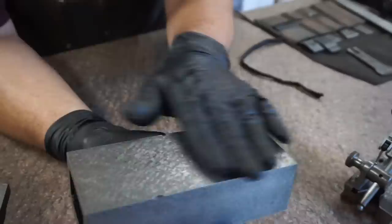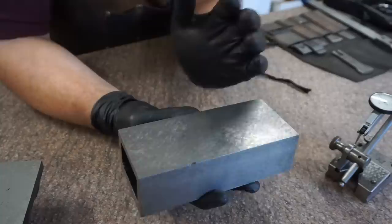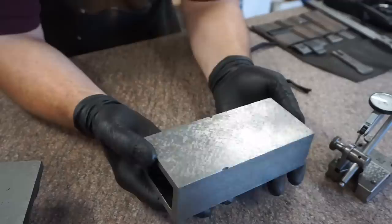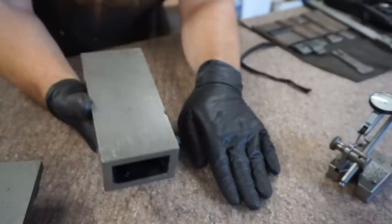And yes, you do need a master plate of some sort, whether you buy a small one. This is one of those circumstances where I'm not against someone going out and buying a nice A or AA grade Shars small granite if they want to do this. You don't have to go out and buy a Starrett or a Standridge plate to get into this. They need a good flat reference, though, to test this stuff on. Right. And we'll show that. I've got a couple surface plates. I'm leaning on one right now. Folks, don't worry about this surface plate. It's a 3-foot by 6-foot pink granite. It looks awful.